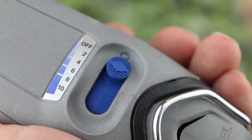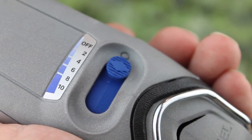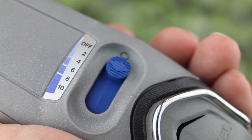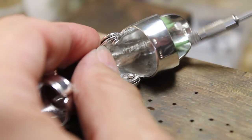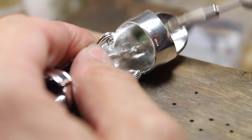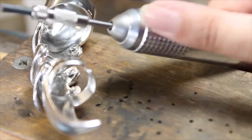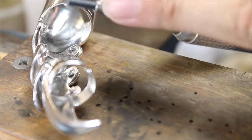These are designed to run at lower speeds, between seven to ten thousand RPM, and this is very important. Too fast and you'll generate heat due to friction, so your piece will get warm. You could also wear a depression in your item, especially with the coarser pins. And of course with any rotary tool, you can always get bits of debris flying off, so it's very important — wear eye protection at all times.